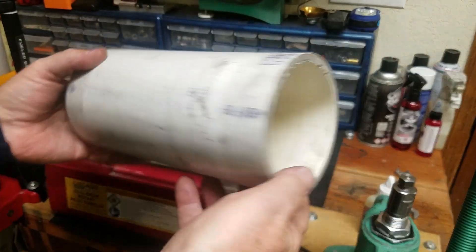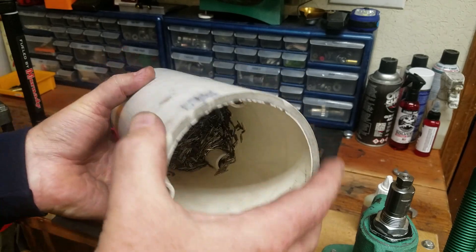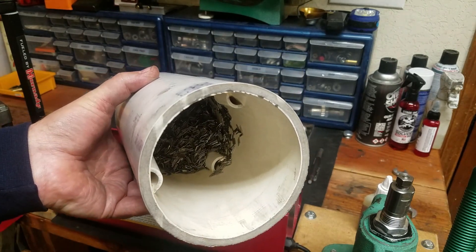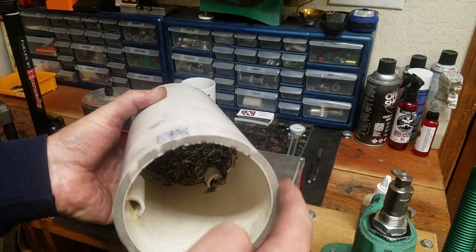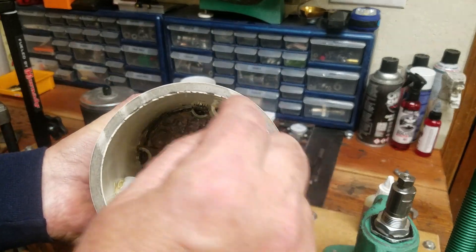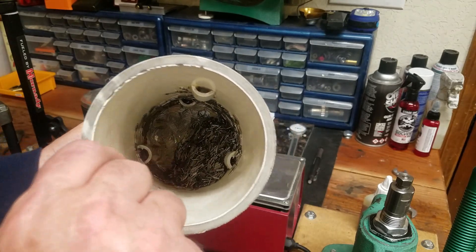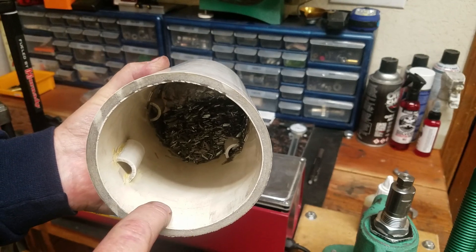This whole thing is based on 4-inch PVC pipe. There are a couple kinds of PVC — there's pressure PVC, which is solid PVC, and then there's this, which is called drain waste vent (DWV). It's not for pressure, which is important because the construction is different. The outer shell is PVC and you can glue it with standard solvent, but the middle is a foam core — hard but not solid — and the inside has a glazing that standard PVC glue doesn't bond to.